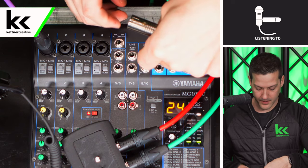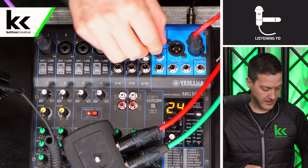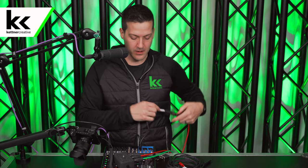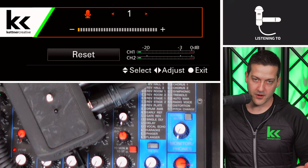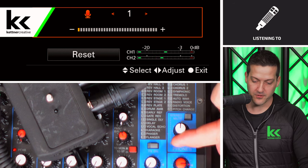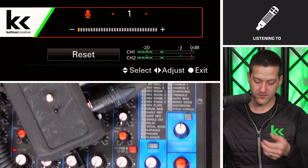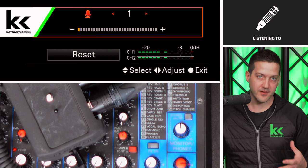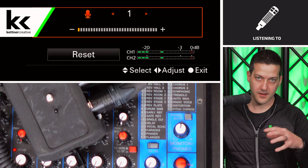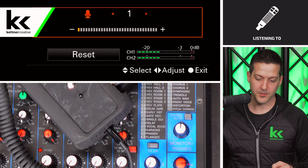I'm going to plug this into my monitor output and move the XLR cables over — the green one is now connected to the left monitor output, and the red XLR cable goes to the right monitor output. Now if we look at the video camera there's no sound because we don't have the main monitor output on the audio mixer turned up. I'm going to turn that up to about 50% and now we're getting a nice healthy level into the video camera. The benefits here over connecting to the stereo outputs is that your audio tech gets volume control over what's sent to the video camera, and the camera operator can also fine-tune that audio.